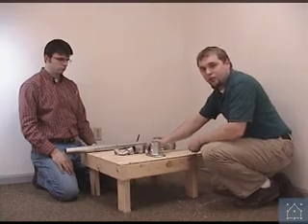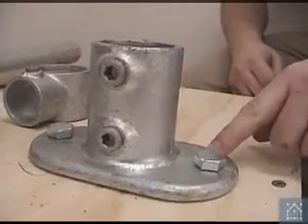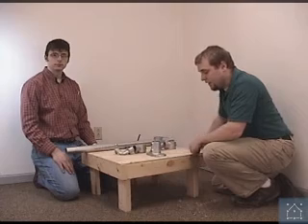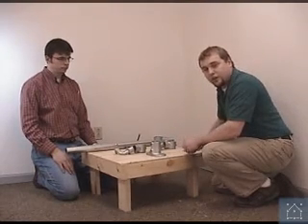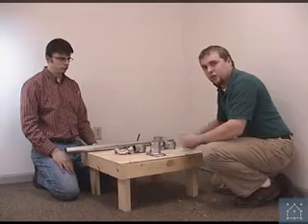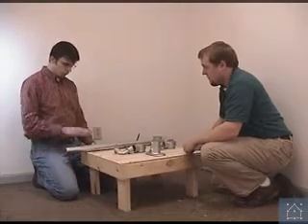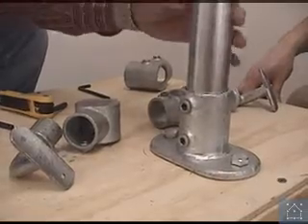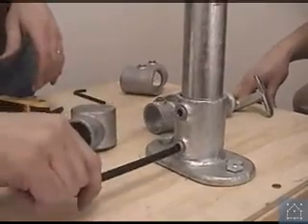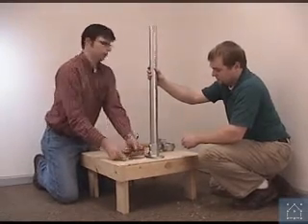Typically speaking in concrete, you want to make sure you have a nice solid connection. You'd want to get some good anchor bolts. The size hole on the base flange is a half inch hole, and you want something with a large head to bite down on the flange itself. Often times what people will do is after drilling into the concrete, they'll put some adhesive inside that hole before putting the anchor bolt, to make sure you have a good strong adhesion. Once the base flange is attached, we're going to go ahead and put on our upright. Once you put it on, you want to tighten down the set screws in the base — it's got two set screws to make sure it's nice and tight.